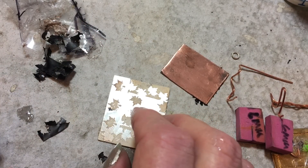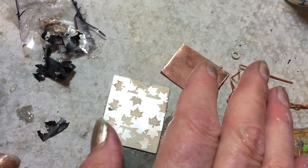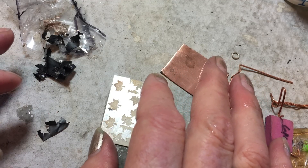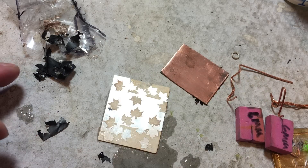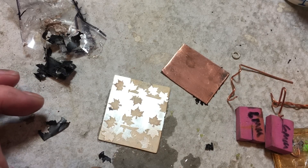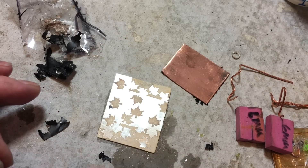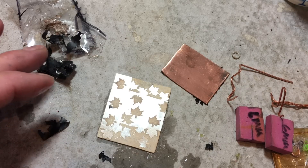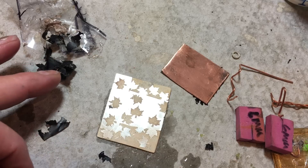The copper sulfate and copper nitrate are exactly the same setup and system — just different chemicals and different ratios of water to the chemical. Check your times often. When you're first starting, I checked it at 10 minutes first and then 15. Remember, this was only in 15 minutes total, so it's pretty rapid on the silver. I wouldn't be surprised if you see 30 to 45 minutes with copper, brass, and bronze. Copper will etch a lot quicker than the brass and bronze though.